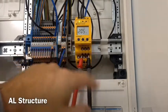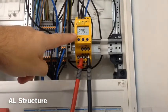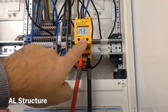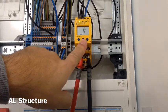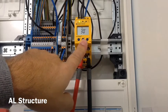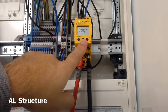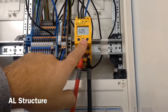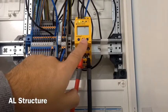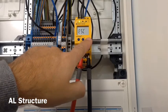Going into alarms, we have the undervoltage set at 205 volts, the overvoltage at 253 volts, the hysteresis being 5% of the U value, and the asymmetric value at 30%. Underfrequency is set to 49.5 Hz, overfrequency to 50.5 Hz, and the frequency hysteresis is 0.2 of a hertz. We also have the phase rotation setting and the escape menu.